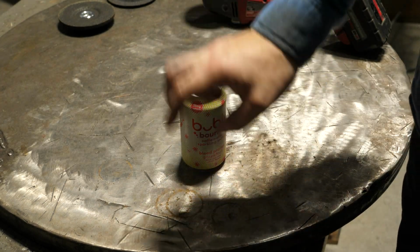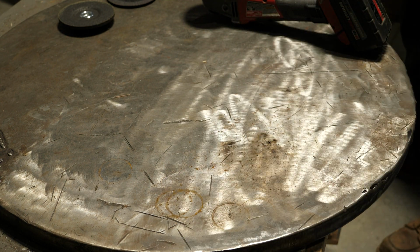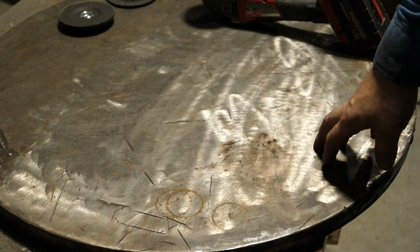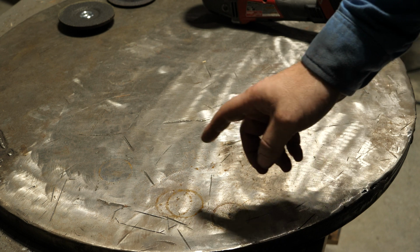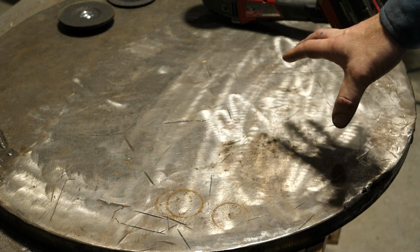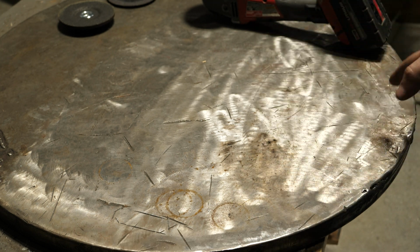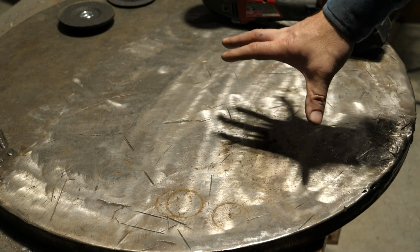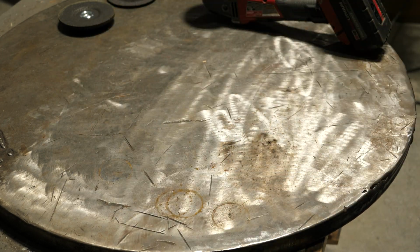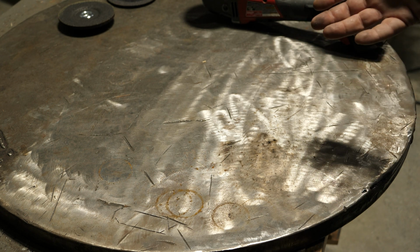and then water sits there. It's going to rust. Now, I did use an anti-spatter on this, but clearly it's anti-spatter and not anti-rust. So there's probably a better anti-spatter product out there that would prevent rust. I just didn't use it. So you can see this is in a little bit rusty shape, especially over here where I didn't buff it, but we're going to clean this all up and look at the different results of the product.